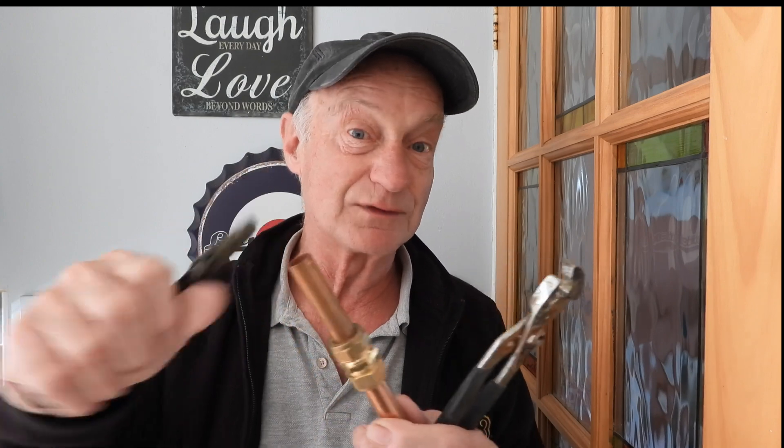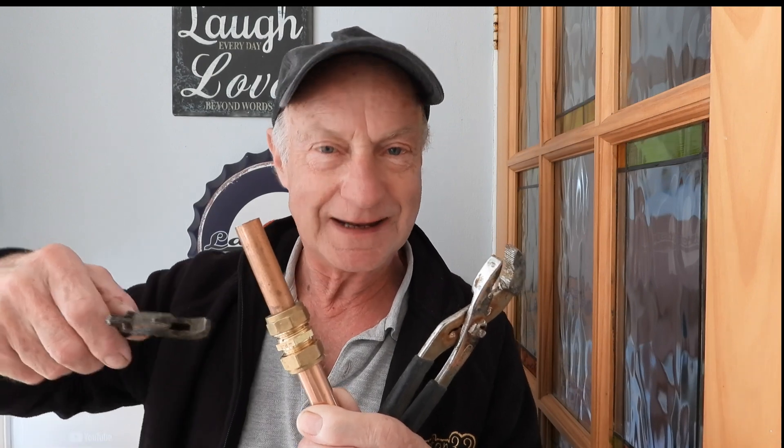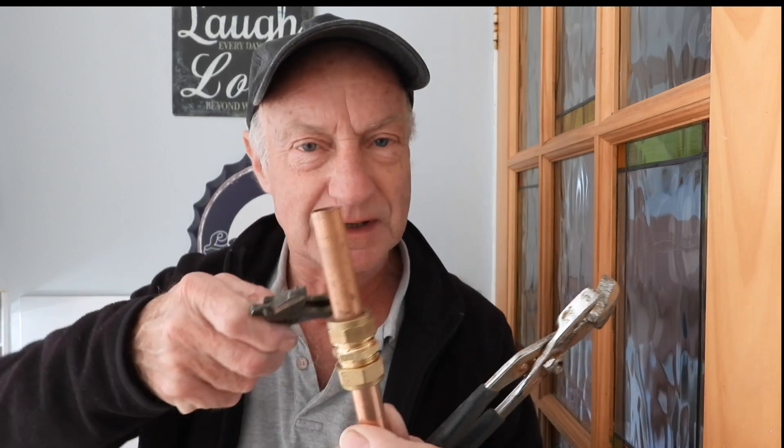That is how much to tighten up a coupling. Do bear in mind I'm using a short stubby spanner, so I've got not quite as much pressure as a long spanner would give you — it's very easy to over-tighten with a lot more leverage. But you can generally feel it come to a stop; there's no more left easily that you can pull. Once you feel that pinch and then that last little nip, that is it — it will be fine. Simple little video, and that's just how much to tighten up a compression fitting. Thanks very much for watching, see you next time!